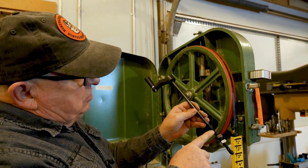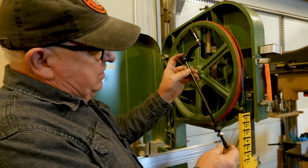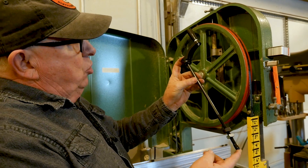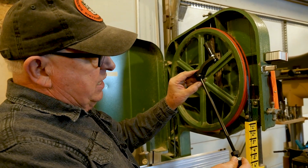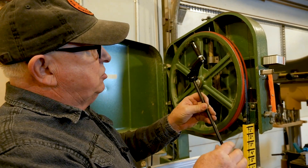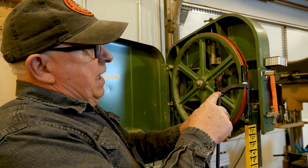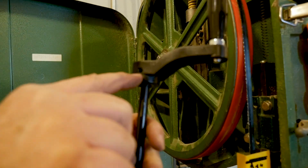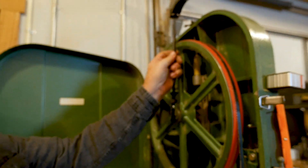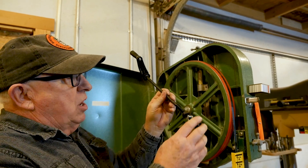What I did is take the Big Horn crank. When you take the handle off, the shaft is 13 inches (33 centimeters). You'll need to cut it down an inch and a half to 11 and a half inches (29 centimeters), then regrind a flat on it for the Allen screw to bite into. Now the crank will sit at about the right level, not up too high, and you can crank it easily. Let's go ahead and cut this down and reinstall it.